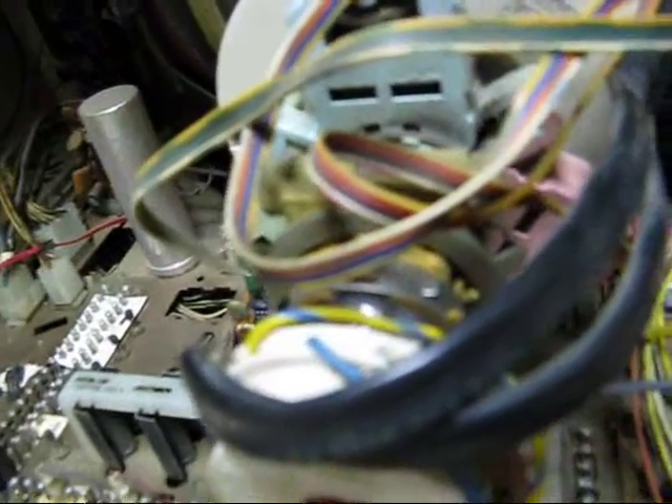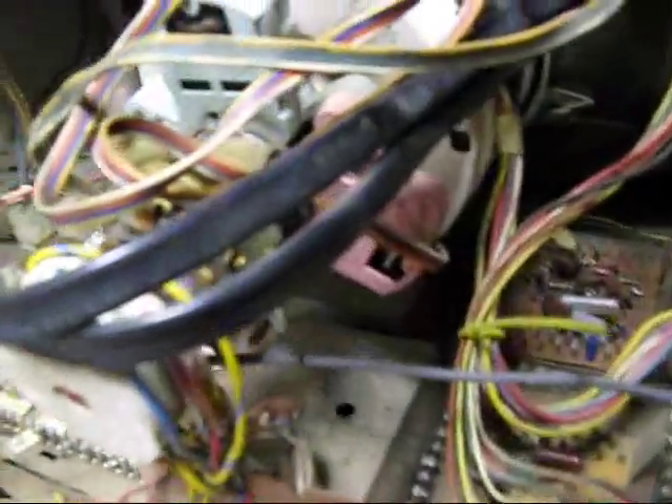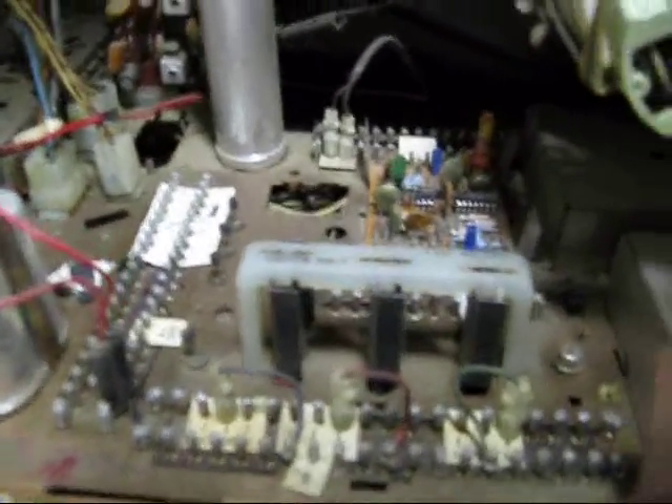When I shift this over into service mode, it goes away. But I can still hear the main transformer hum a little bit, and I expect that. But then you get back — it almost sounds like a little video hum. So I'm not sure if that's just from age or if there's something else going on in here. All the voltages are pretty good in this set. 24 volts — we get 23 and a half. Our B+ 125 is at 125, and it's rock solid.